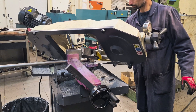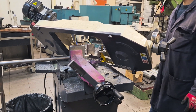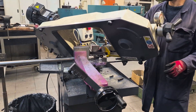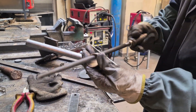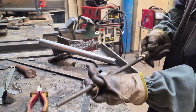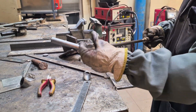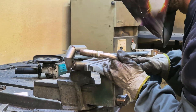Initially I cut the 40 millimeters diameter alloy steel main tube with the alloy steel band saw. I cut the pieces at 30 degree angles to make the 180 degree bend, then I removed the alloy steel burrs from cutting with a round file. I proceeded to weld the main pipe in order to build the 180 degree bend. The equipment used for welding steel alloy was the MIG MAG machine.